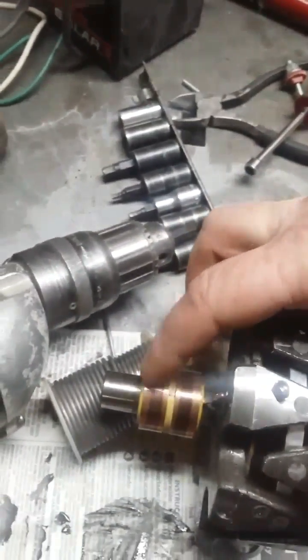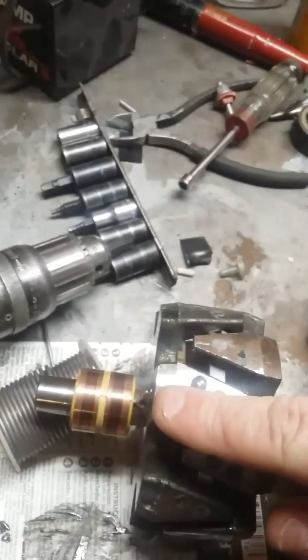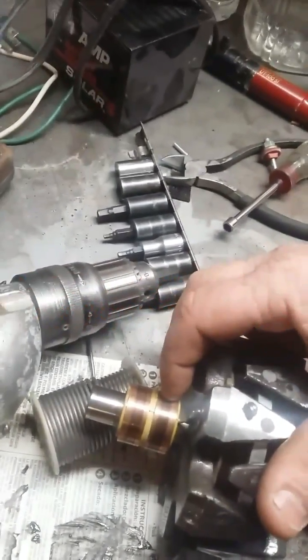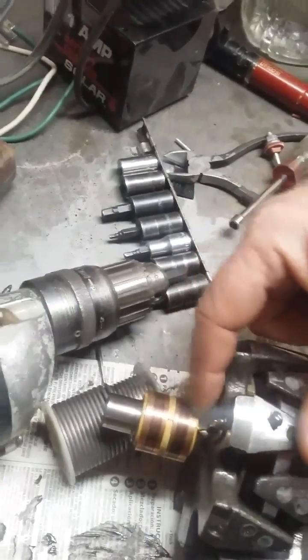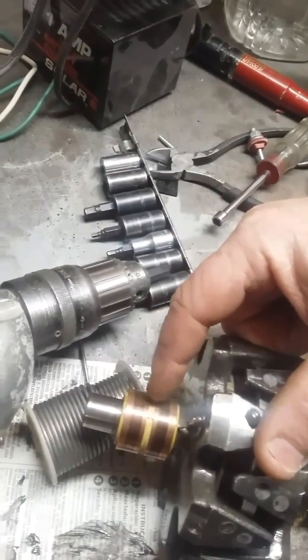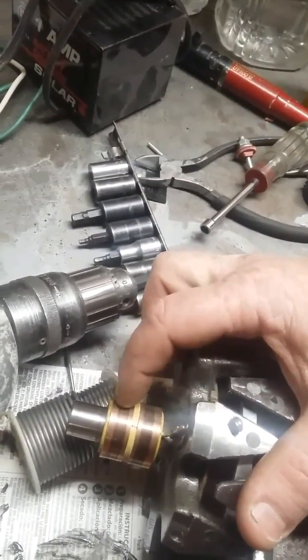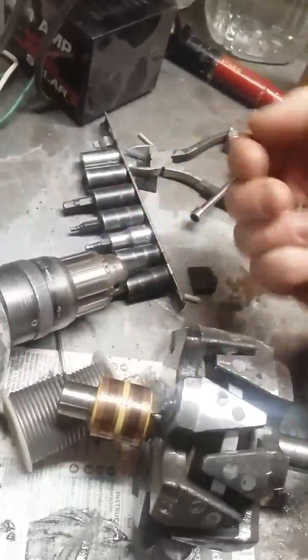This was tricky because on these slip rings is where you apply your power, and you have to determine which pole is north and which pole is south. You can change it — you can decide which one's going to be negative and which one's going to be positive. I determined the inside ring was positive and the outside was negative, and once I energized it I just took a battery charger and hooked it up.